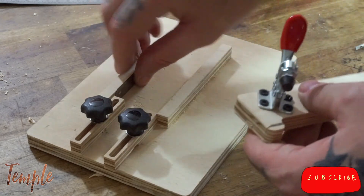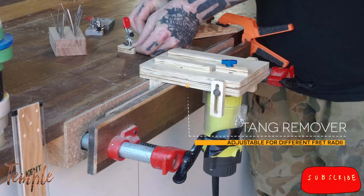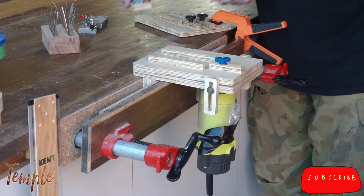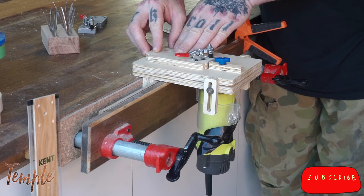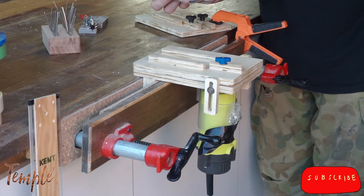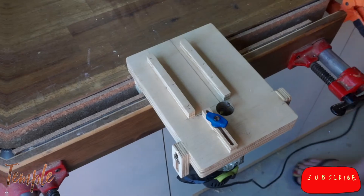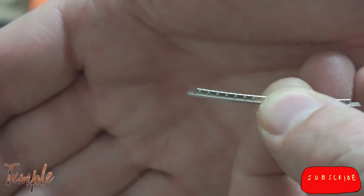The reloading jig is done, so let's give the whole system a test. Here is our setup — we have our adjustable fret tang remover. I'm loading a fresh fret into the fret holder, and that holder is in the reloader. Let's cut some frets. Putting a fret into the holder, not clamping it down until it's been loaded. Now it's clamped and we can grind it. You can cut these tangs a lot faster than this, but if you take your time like I am, you'll get a much cleaner result. I'm just switching the fret around in the holder, putting it in the reloader, giving it a clamp, and then feeding it back in to do the other side. It's so easy. Here's the view from the top. And here's the ground tang — it just looks perfect.